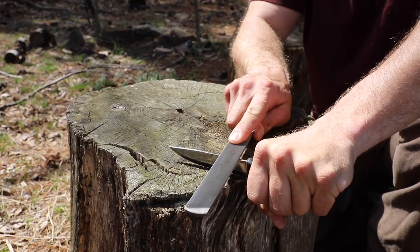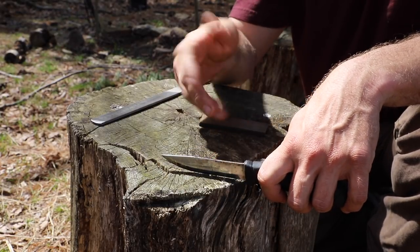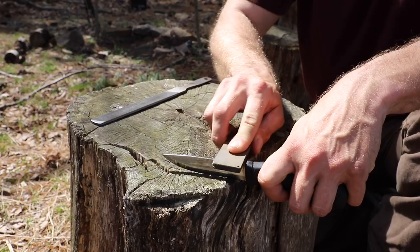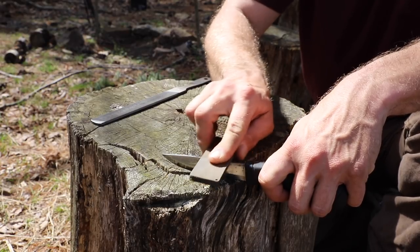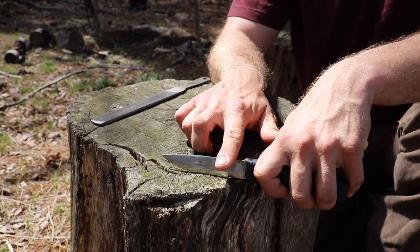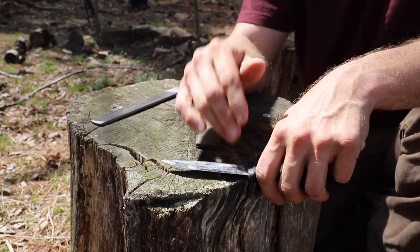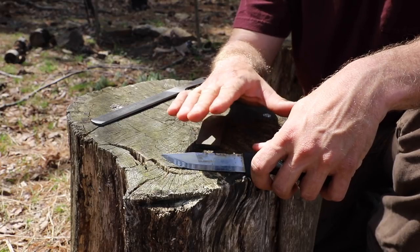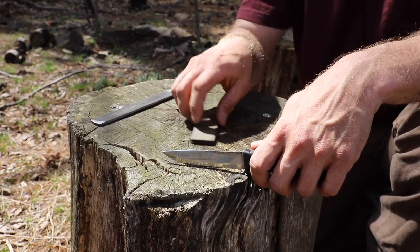Once you get so far along, flip your file over and begin to cut with the finer side. Now that my filing is done, I have a good sharp edge on this Mora. I can then take a sharpening stone right on the top and just begin to work it back and forth, being careful that I'm not rocking the stone at all — nice and flat right across there. Once you've worked on that for a bit, feel that edge and it should start feeling really sharp. We're not ever going to work the sides, because human error puts too much of a bevel on each side and removes the spine. There might be a little bit of a burr — just leave it on there. It's not going to hurt anything; it'll get removed over time from using it. Just leave that burr on there and we should have a nice sharp spine.